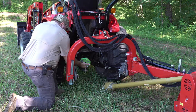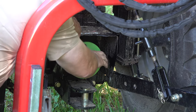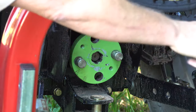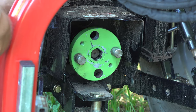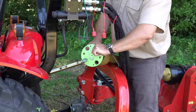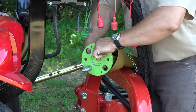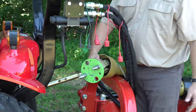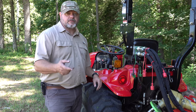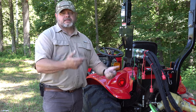With this system you only have to do the initial setup once — you slide it up, push the button, and lock it into place. It's much easier because it's not as big around as the full shaft and heavy. Once it's locked on permanently, you take the PTO adapter, push the button on your PTO, and rotate it until you find the point that slips in and locks into place. Make sure your PTO is in a neutral position so it rotates freely — you don't want to have to rotate the flail mower over.